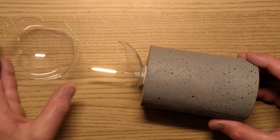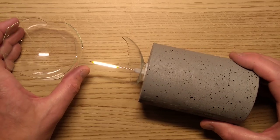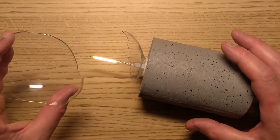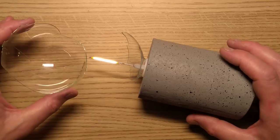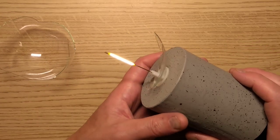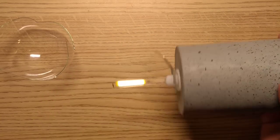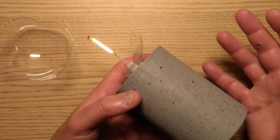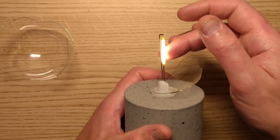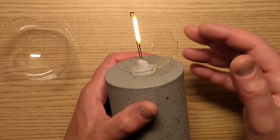This video was supposed to be about this Sainsbury's outdoor garden light. Initially this light did have a globe on top — here's a rough indication of the diameter, maybe about three or four inches. The whole point of this is that it's an outdoor light that runs off three rather undersized AAAs. I didn't realize it was waterproof for outdoor use. It's got one of these LED filaments, presumably with all the chips in parallel, in this sort of plastic pinch seal in the globe.